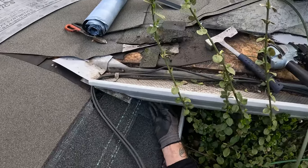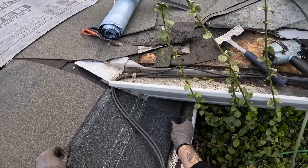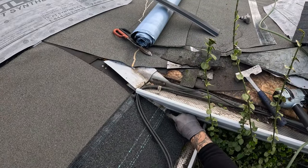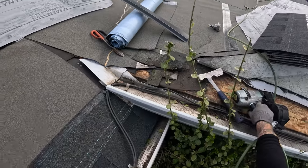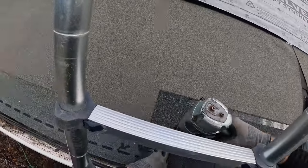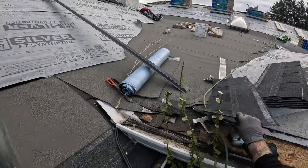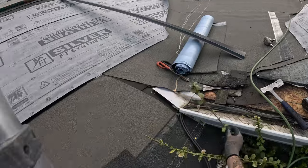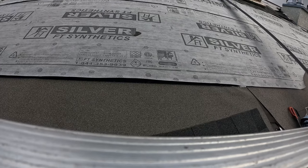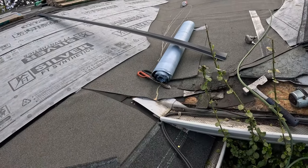Now you want to make sure that's tight — tight up to your metal. That's shingle one. You want to make sure this is sitting above your reveal. Don't nail right close; give it a little bit of space. Once those shingles seal, wind is not going to be able to get up and pull up the trough. For cuts inside the valley, I flip my shingle over, make my cut, and put a little bit of bias on it because they typically like to run up. Then tight on the inside, square here.